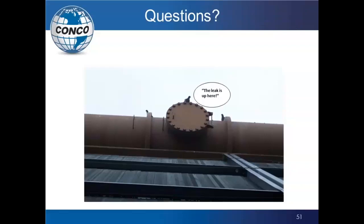Water consumption is a big concern — how does the automatic system compare to a fire hose or lance in terms of consumption and efficiency? The automated system needs 48 GPM, and you can calculate how much water you'll use based on your unit size — it's consistent, on an automated timing schedule riding up and down the rail. You can slow or speed that based on your needs, but you're looking at 48 GPM consistently. With a high-pressure lance or fire hose, consumption is completely dependent on the person using it — how thorough do you want to be?